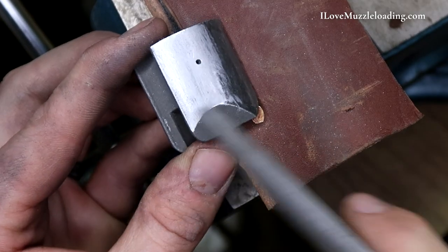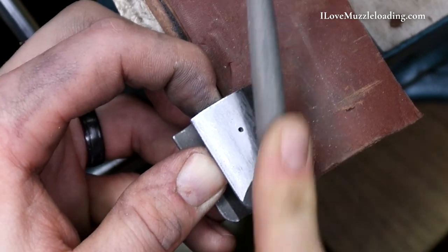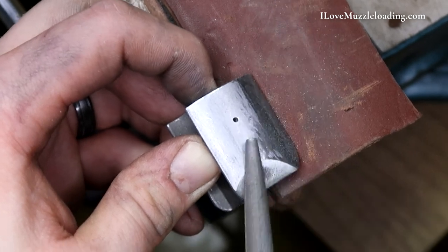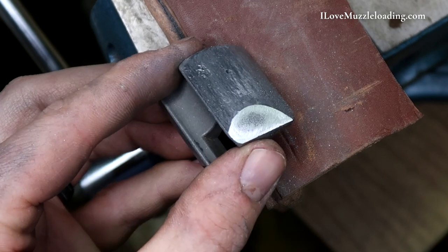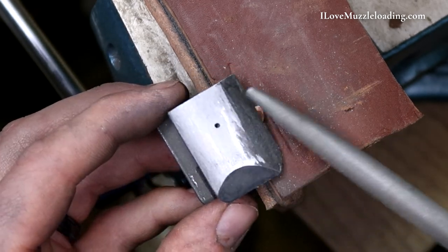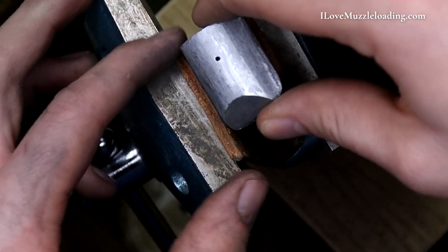Now I want to be conscious of this line here between these two faces because I'm holding this with my hand. I'm kind of buggering up this edge here, but as I come in and start to work that face, we can start to clean up that line with our file as long as we stay on target with it. We'll make sure that we're just continually indexed with that face — not wibble-wobbling — and you can see there that line starts to clean up pretty quick. I'm not going to fully work that face because you can see it cleans up pretty good. We're going to work on getting this side cleaned up before we go hog wild, then kind of use that as a safety, knowing that I can come in there and clean it up if I work that spot.